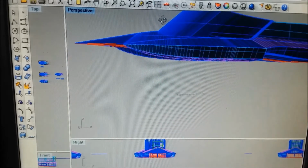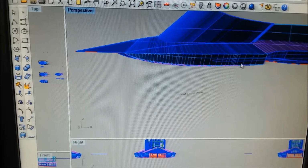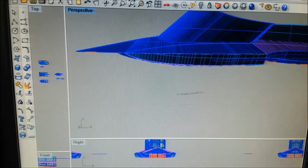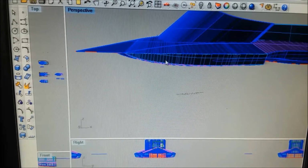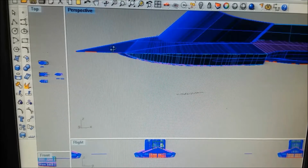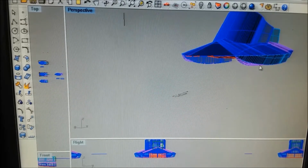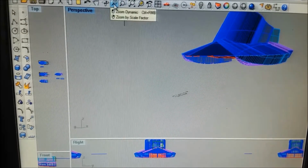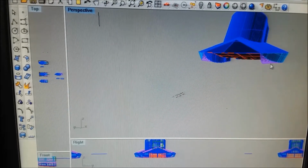The front here is nearly level, rides above the water because the boat is sitting on this right here and that little bit of tailplane. So this just cuts the air and forces more of it to go down underneath. The sponsons here, they edge up. So as more and more the boat comes out of the water, as the speed goes up, less and less is touching the water. It'll eventually get to where it's riding on maybe 4 inches of this by about 2 feet long.